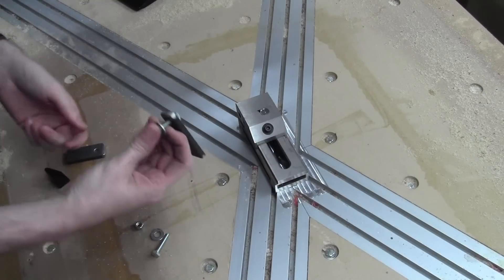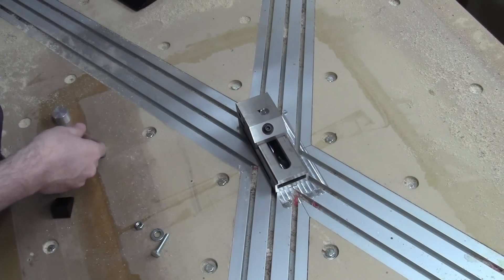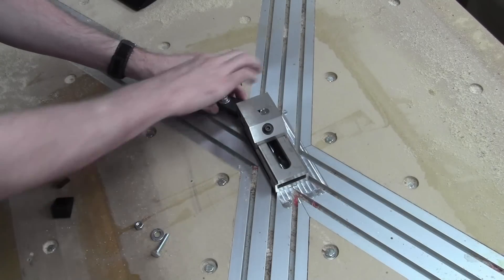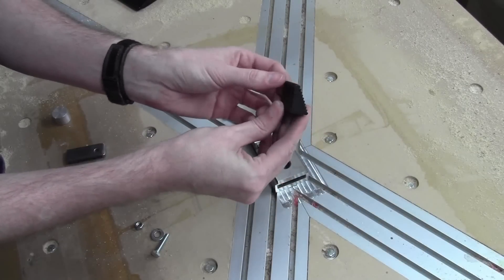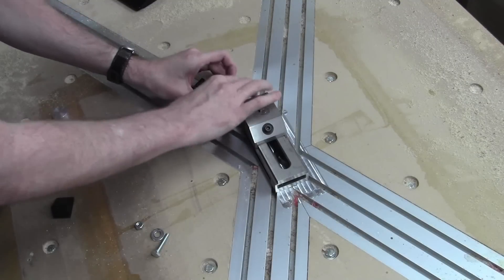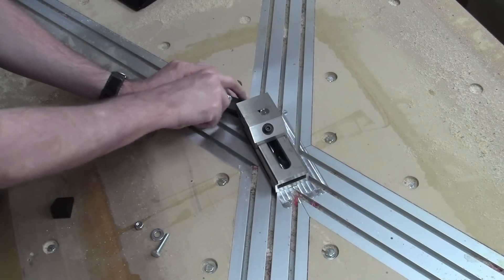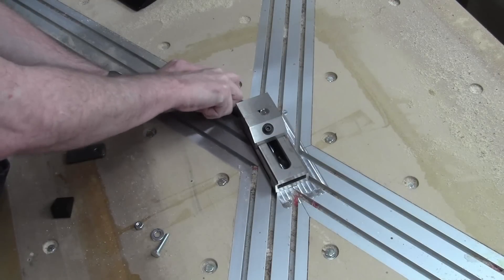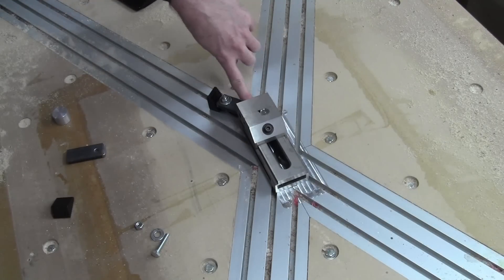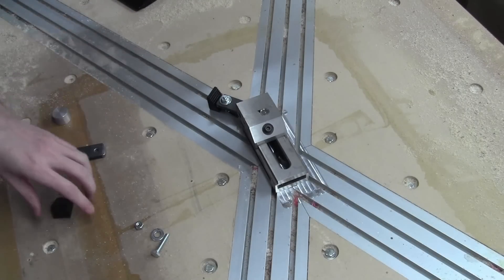Then I take these steel strap clamps and bring them in through the T's, bolt head down. There are these little notches cut into the sides — for a milling machine these are really handy little steps. They hold a strap down on the opposite end. The clamp registers in those little steps and then you just tighten down your nut here and it will pull everything down. You just want to be one step above level on this so that the toe of the strap is pointing down.